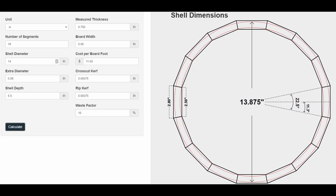I've mentioned the 11 and a quarter degree angle multiple times — here's a calculator I use online, just Google 'stave drum calculator.' I'm using a drum that has 16 flat edges or staves. When you have 360 degrees divided by 16, you get 22 and a half degrees. Cut that in half — because two pieces together make that angle — and it's 11 and a quarter. That's why I keep mentioning 11 and a quarter degrees for the drum.